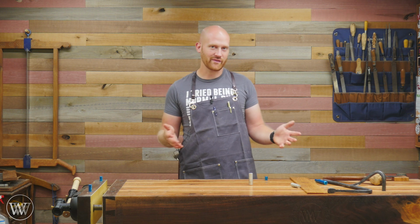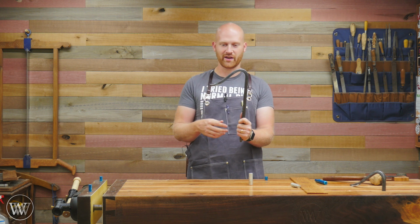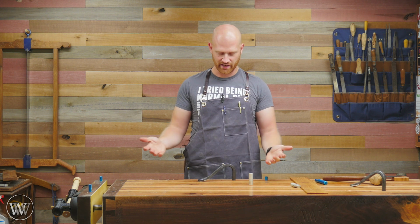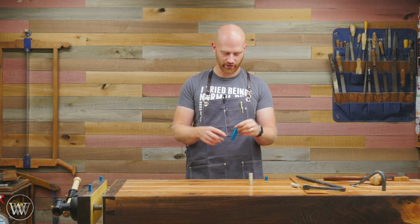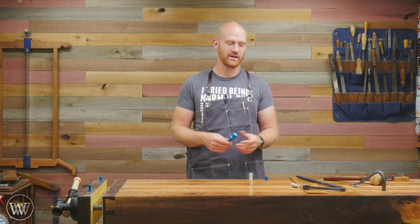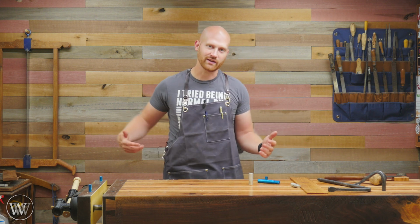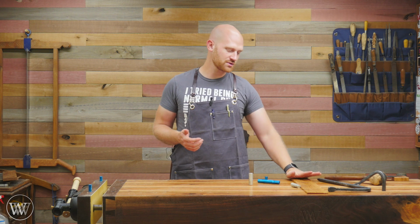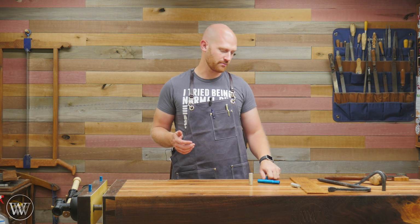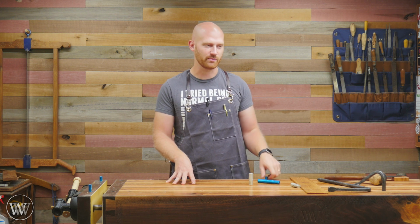And I really like how they're just simple tools. I mean, a holdfast is just a really, really simple design for a clamp. Holds things in place, and you don't have to mess with it too much. I really like that. Bench dogs, very simple use, how they just slide in a hole and hold things in place. The planing stop is fantastic for planing because I don't have to, you know, unclamp and reclamp it every time I want to look at the board. I can just pick it up and use it. And I'm wanting to use those a lot more than I did on my old bench, mostly because I trust the holes in this hardwood top a lot better than I do in the Douglas fir bench. But even then, that probably wasn't that much of a problem.